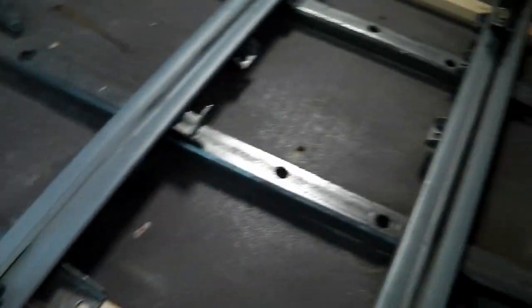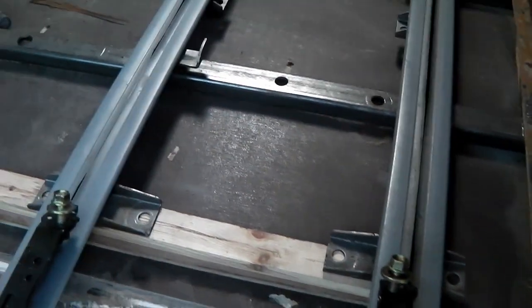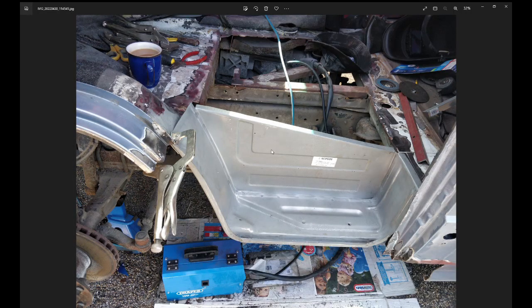It should look good, might take a little while, but I hope it will work quite well. Here we are offering up the footwell on the passenger side. You can see I've cut away the rot from this wheel arch here and repaired the section where there was a hole just on the inside, offering up the footwell making sure that the line of the door follows the seal of the footwell.